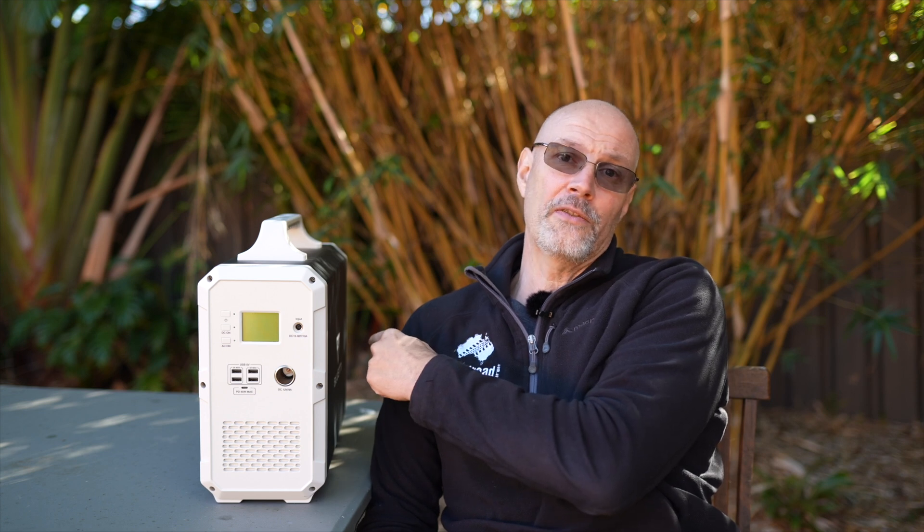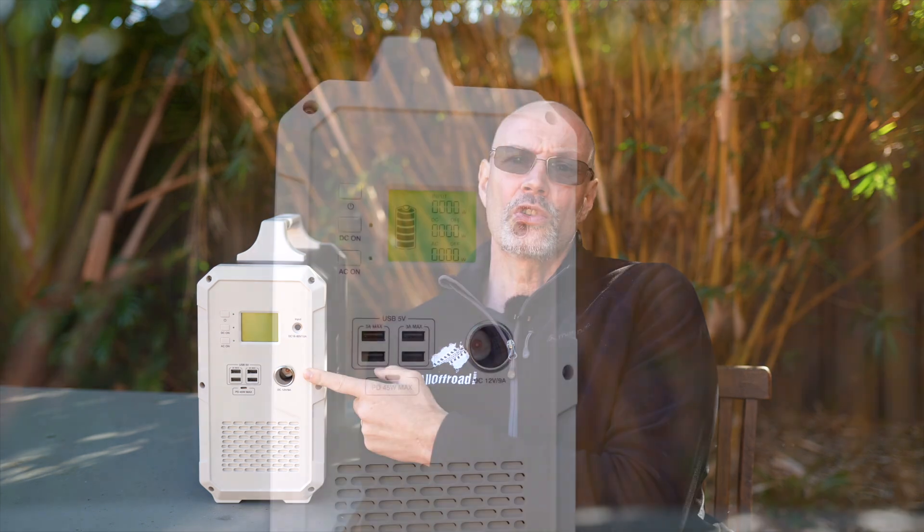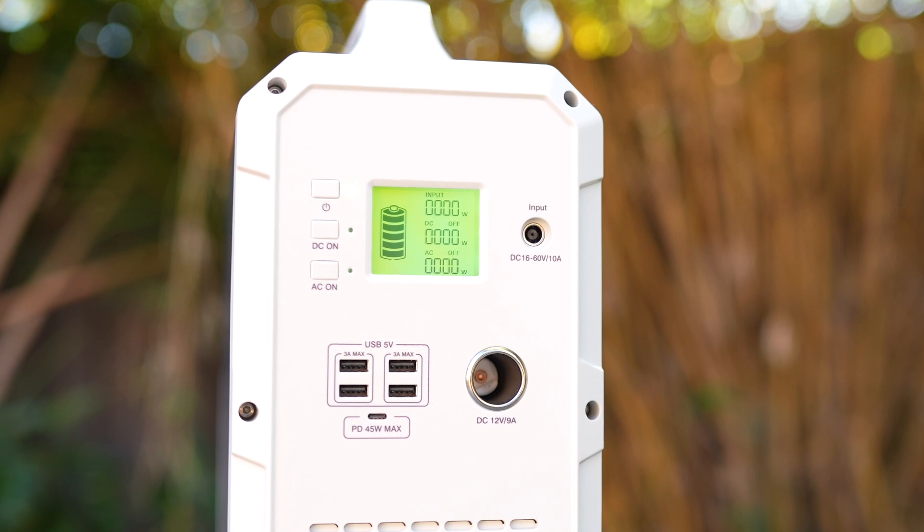One small thing to consider is that all the DC connections are at the front and the AC plugs are at the rear of the unit, which limits you a little bit in where you put the unit. If you have a camper trailer or an RV and you want to stack it away into a shelf, keep in mind you'll need room at the back for the 220 volt output. I personally would have liked to see the two 220 volt sockets at the front. One other improvement I would also make is to make the unit IP67 — at the moment it's only IP21 so you really can't leave it out in the rain. It would be nice if you could actually cover the plugs and if the casing could be IP67.